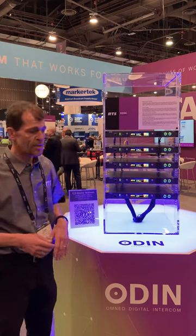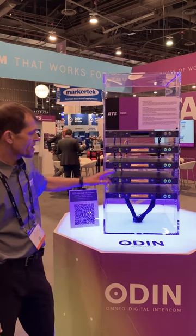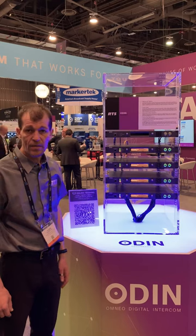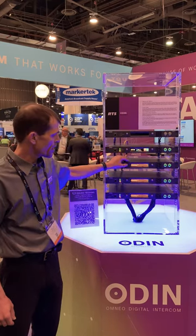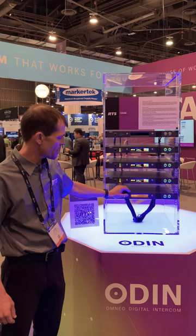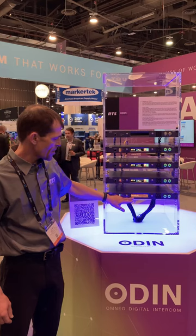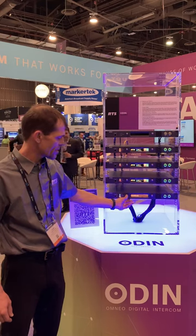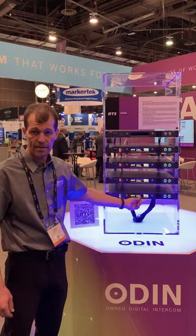To simply demonstrate this, I'm just going to power off the first frame here. You'll see that the other frames have detected that the frame has gone away — audio from frame one. I'm going to go ahead and clear these messages so you can see that it comes up. We have two, three, and four. The bottom frame here is now sensing that it needs to take over, and it has now come up as frame one of the active system.